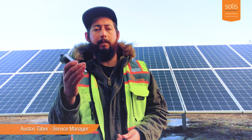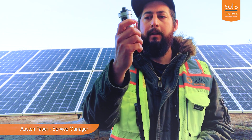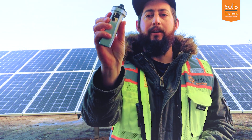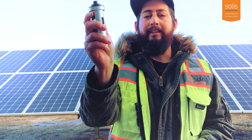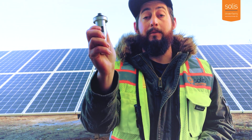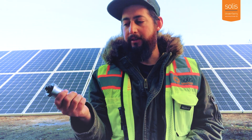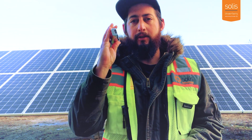The update stick has a four-pin connector at the top, USB at the bottom, three LEDs on the front, a reset button on the back, and a pinout on the side. It comes with a special cable for pinout firmware upgrades, but typically if you're a customer in the field, you won't be using that — you'll be using the USB on the bottom.